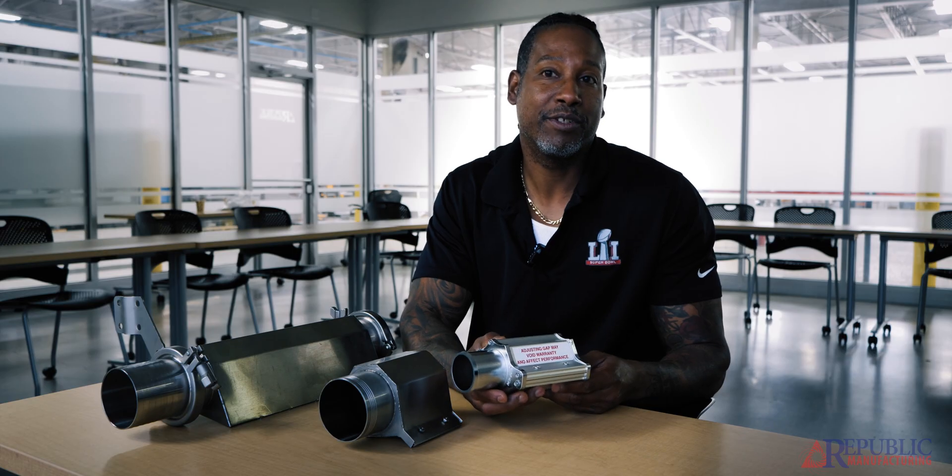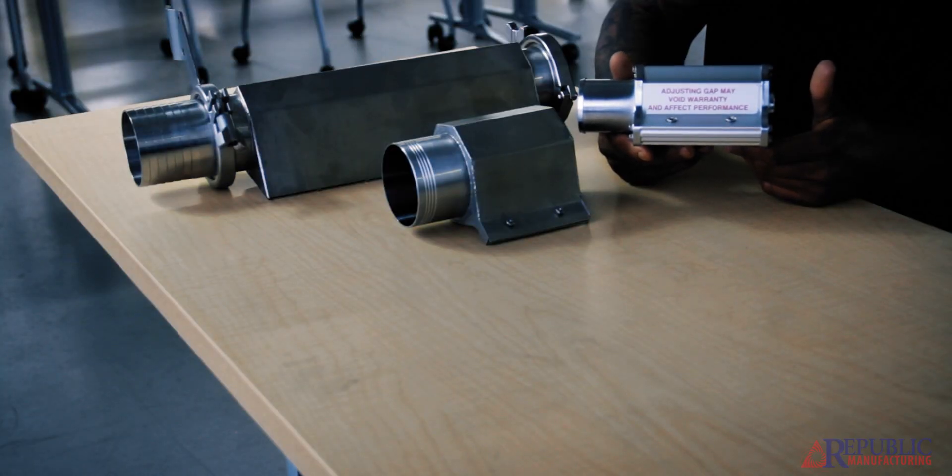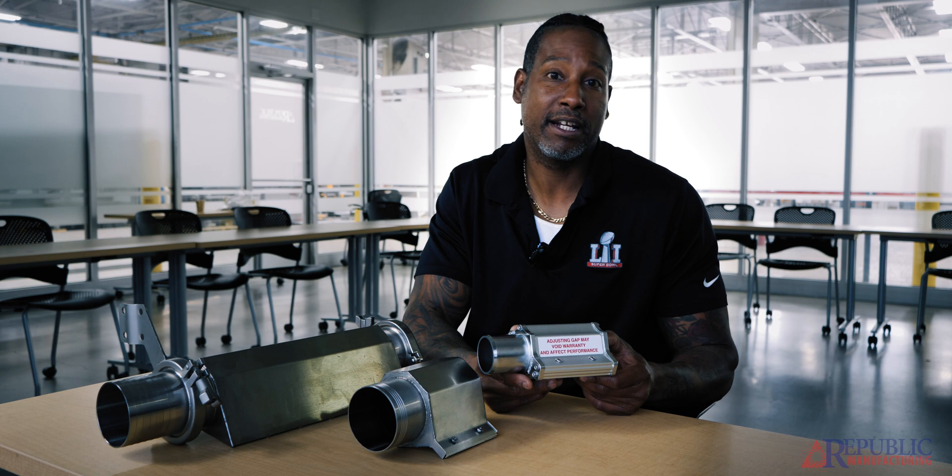First we want to talk about the most popular one that we have, which is our aluminum air knife. Our aluminum air knife is more of a general-purpose air knife. It is used for multiple applications — a lot of bottle drying, a lot of things that are sealed already. A lot of it has to do with general wet environments and nothing caustic or anything like that. The aluminum one also has its own clear anodized coating on it.